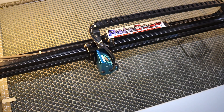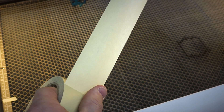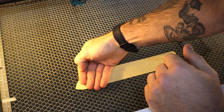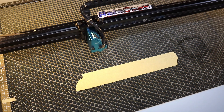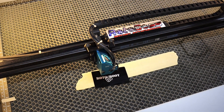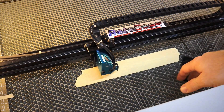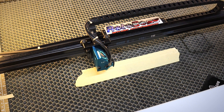So now we've got our tape and our bed set up. What you do is just take a piece of tape — I do about 10 to 12 inches long — tear it off, place it on the bed approximately where you want it, and stick it down. Go back to home, do your autofocus, let it focus in on the bed. Once that's done, move that out of the way. Then go ahead and hit your origin.